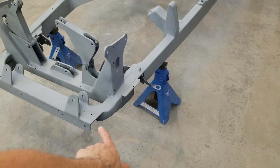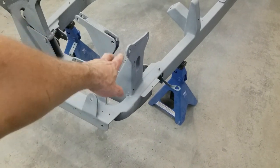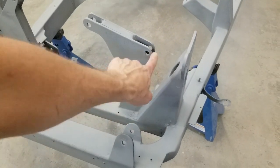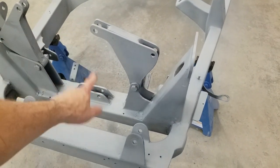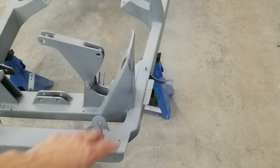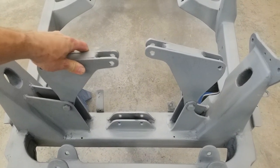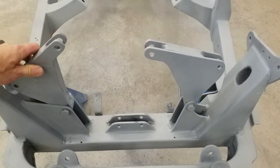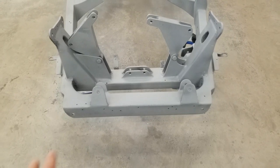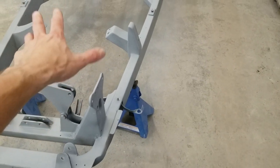You have your lower control arm that ties into the pivots down below, and the upper control arm that bolts to the plate area there. A push rod comes from the lower control arm up through that channel within the frame member, pushing on a bell crank, and that bell crank activates the coil-over inside. All of this is clean — no complications — just a really clean front end. As you're driving down the road, that pivots back and forth. It's really simple and handles amazingly well.